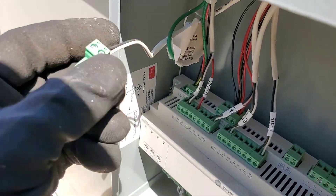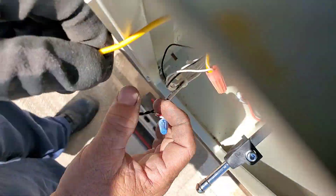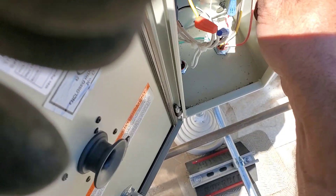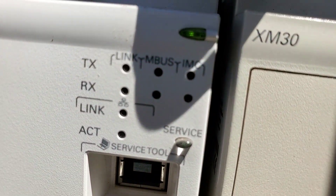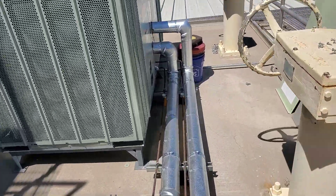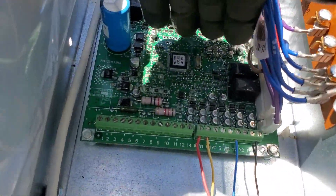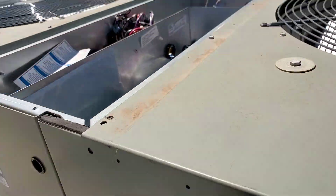Red and blue coming from - yep, black and red tied in there. Right here is going to be the other one - I could disconnect it right here. This transformer is guaranteed going over to that compartment. I'll reconnect it and plug in from the transformer up here. Lights are on, green lights on there. I'll unplug it while I watch - it went out. Now I'm going down to the condenser.